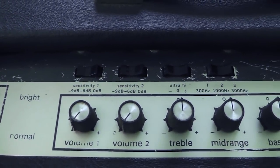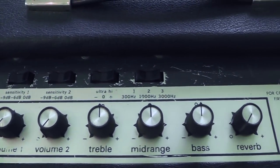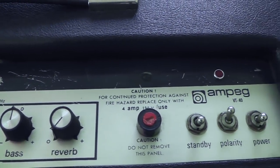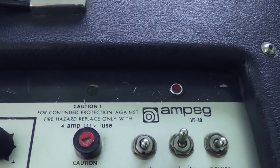And of course the other owner just rode the amp like a dead horse, you know. All the tubes were bad, capacitors were bad. And over time, when I used it again and put some new tubes in, other problems occurred. And the latest was then that the power transformer gave up.